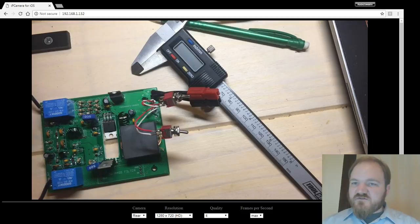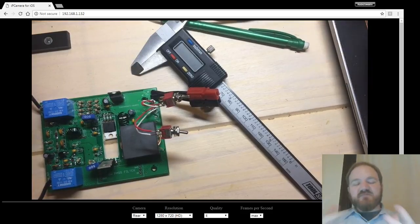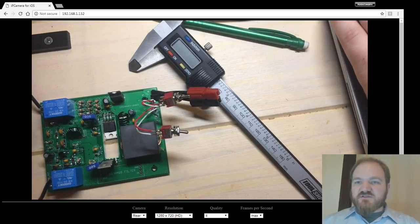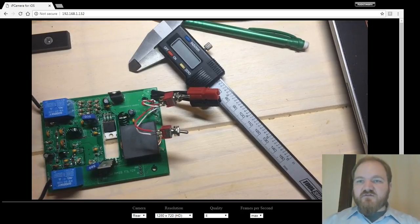Let me remind myself. So those are 3.2 millimeters diameter. Yeah. So they're sized for, I built it, I punched them for an M3 screw, which will be great. So now all I'm going to do is do two circles. The inner one, which has diameter of the hole, and the outer one, which has diameter of the standoff diameter.